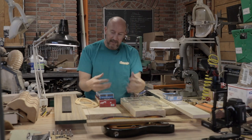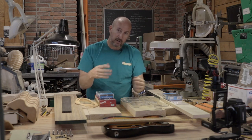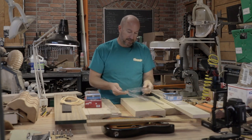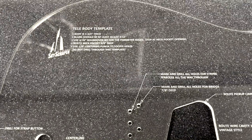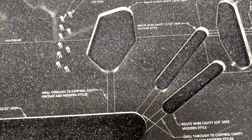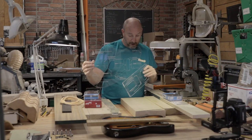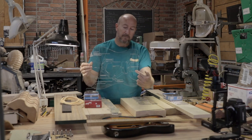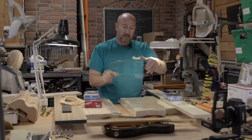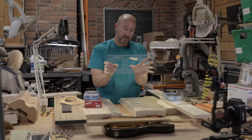The custom build won't have a pickguard, while the stock build will. The idea is that by paralleling these two builds, you'll be able to make your own decisions. Let's take a quick look at the template set for the Telecaster. I like clear acrylic because you can put your center line through it and always find it, and you can line up the grain because you can see through it. This template has options for different electronics routes - pretty standard holes for the bridge and electronics cavity. On the back side of the body there's no neck pocket route - a separate piece lines up using two bridge holes to route the neck pocket.